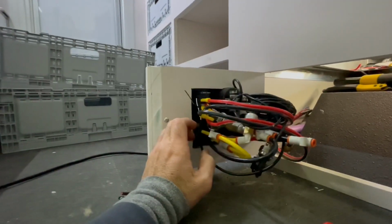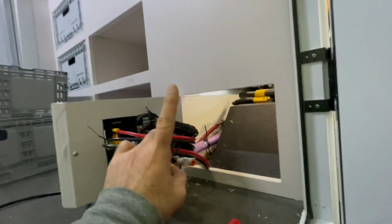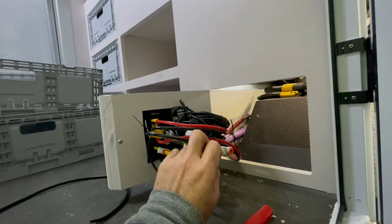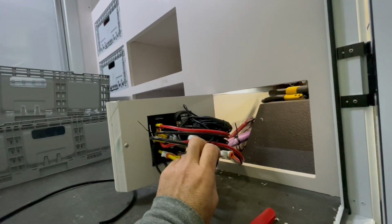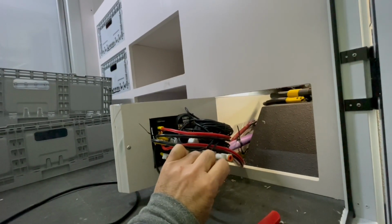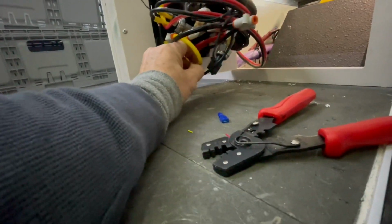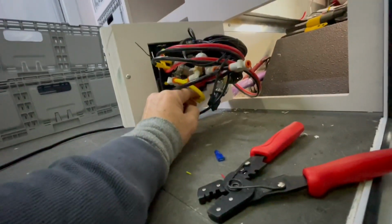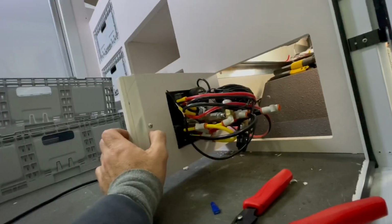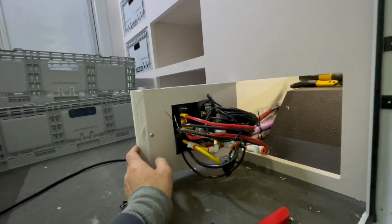Yeah, next I've got to get some air line running. So I've got to go from the compressor, which is mounted up there, to the black tank that I've got mounted underneath the back, which I'll show you. Out of that black tank, all the way back to here, runs into that point there. And then there's two outlets here, one for either airbag, that I've got to run back again to that same spot, and drop them into the airbags on either side with threaded fittings. So I'll get onto that now and see if we can get this thing a-rocking.